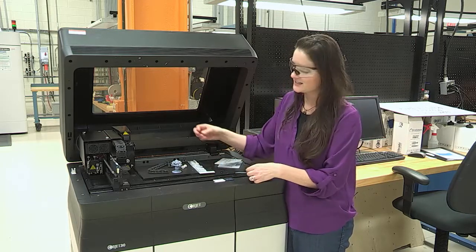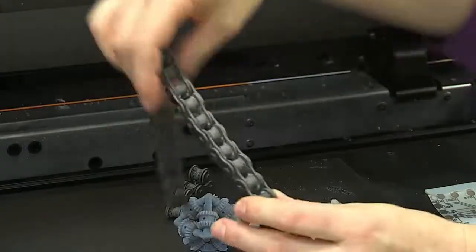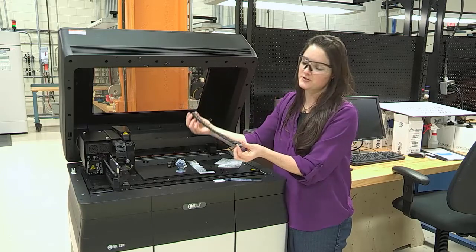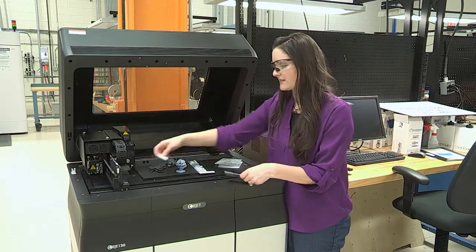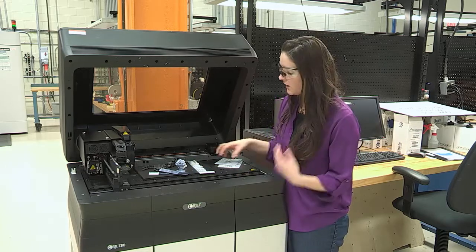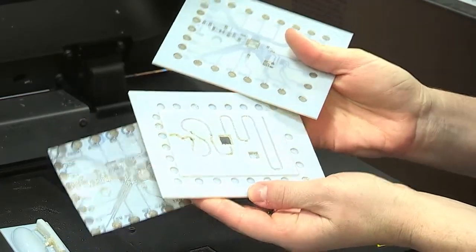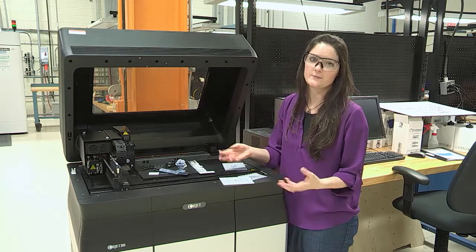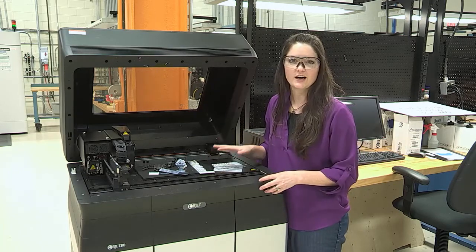The only downside to this technology is that the material properties are still pretty lacking — photopolymers have a long way to go. But you can do assemblies with no assembly required. If you get the clearances right between the joints, you can do mechanisms like this chain, no assembly required. Of course, this is a plastic chain — you wouldn't want to put this on your bicycle — but it's a really great way to model things. Here at Oak Ridge, instead of asking what the structural applications for this technology are, we want to ask about the functional applications. Maybe a functional application is a printed circuit board — we can use this dual ink process to deposit inkjet nanosilver and our non-conductive photopolymer, and make a composite structure with actual functional properties.